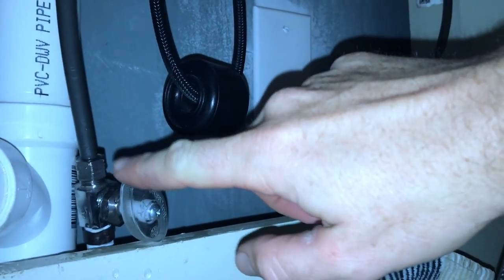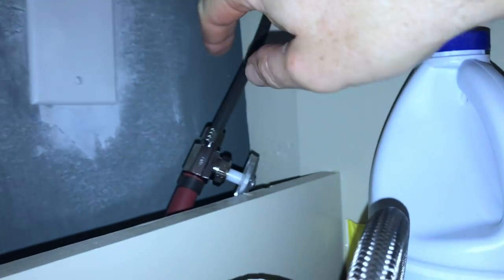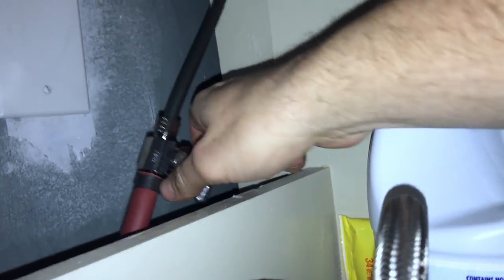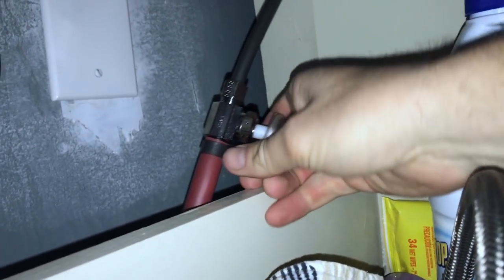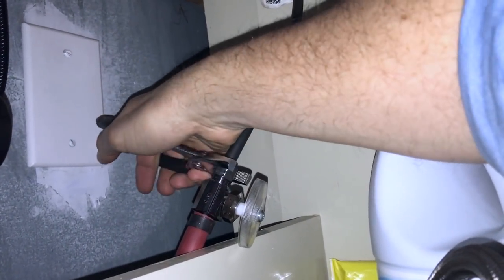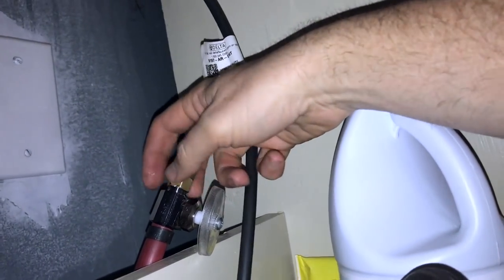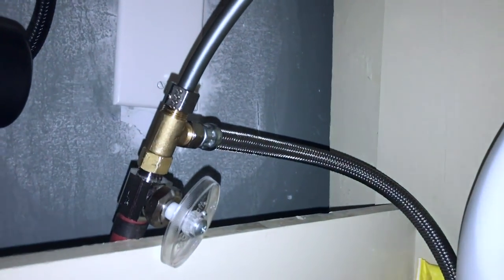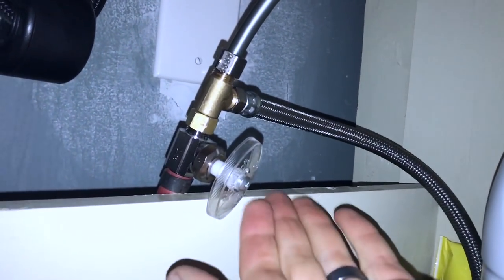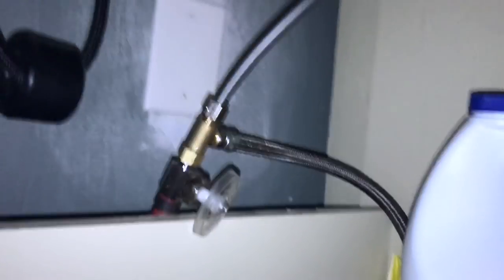As it turns out, you put in the hot water for the supply. I was thinking maybe you just put in a water supply and it heated the water to the temperature it wanted. No — you have to do a hot water supply into the dishwasher. We've been running this dishwasher trying to figure out why it's not completing a cycle. So I have disconnected from the cold water line. Now I need to connect to the hot water line. Turn it off, tie it into the hot water line, and we'll try the cycle again.